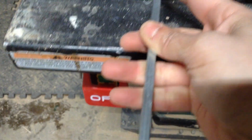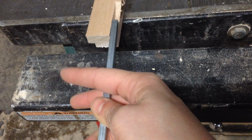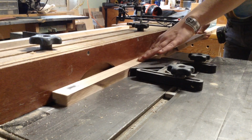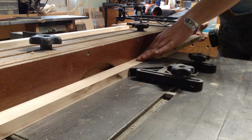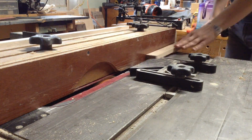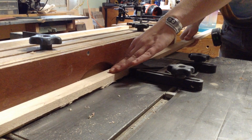The plywood, you can see I have a 1/4-inch key stock, so this plywood is actually a true 1/4-inch. And then I have the maple I ripped into strips, which is the front, so that is 1.25 inches. And I basically just made sure I had my dado stack to cut a true 1/4-inch down and a 1/4-inch across. So this is going to create almost a T-like piece of molding that will slip inside of my torsion box.